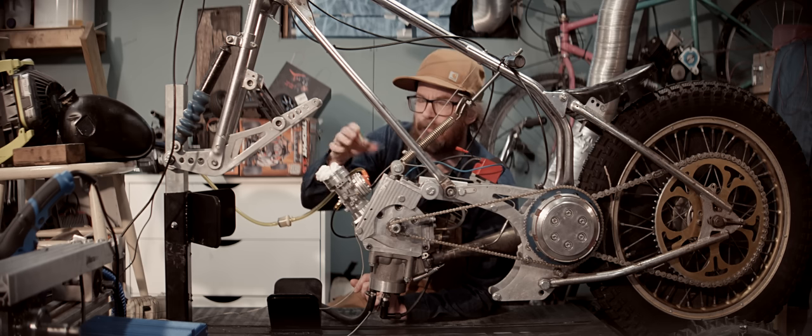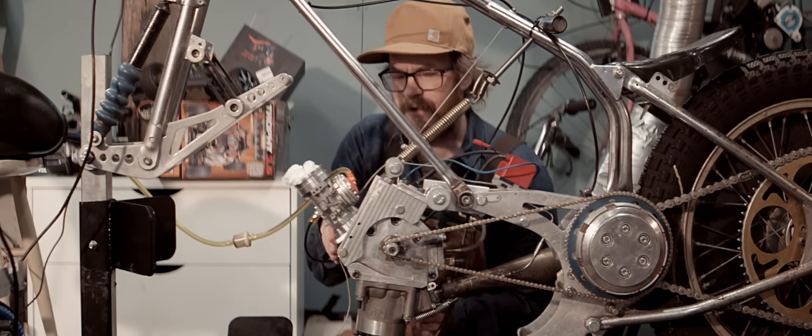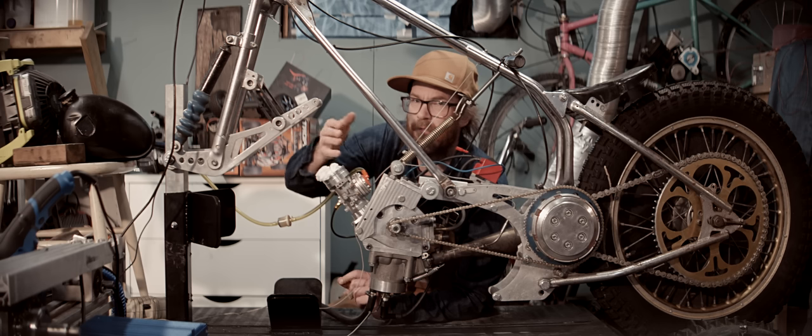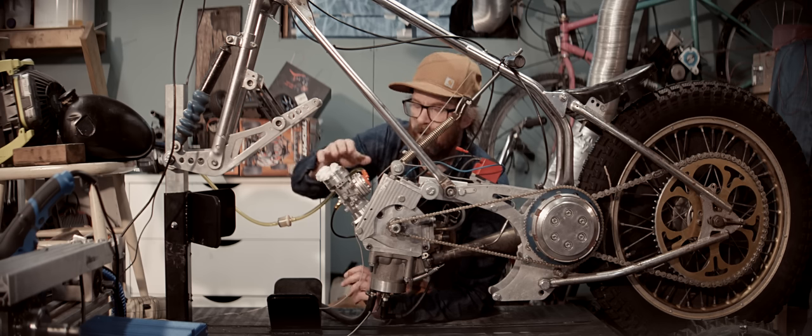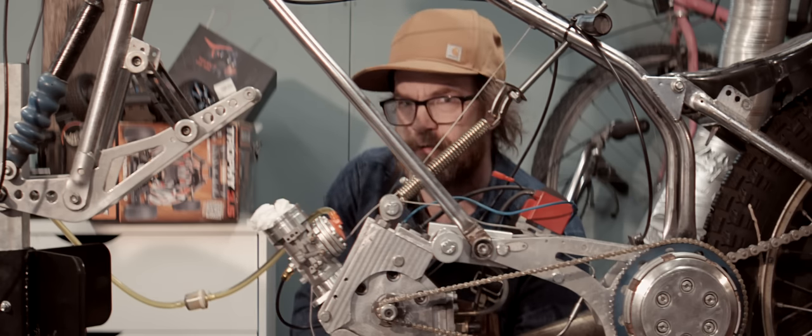We're talking case volume of 370 something cc, if I can remember correctly. 1.18:1 compression ratio, which is really low for a reed valve. We need to bring it up to at least 1.3:1 to make this work with that reed. So plan now, take off the cylinder, make a stuffer.